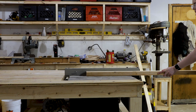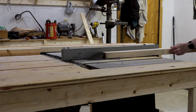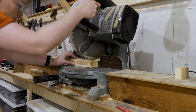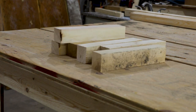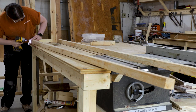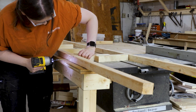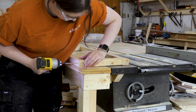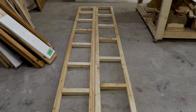Next, it was time to get some more functional storage shelves back onto these walls. I really like the other shelves my uncle and I built last year, so I decided to do the exact same style on this wall too. The bulk of the shelf is made out of 2x2s, so I got to work ripping some down from 2x4s I already had on hand. I'm building an 8-foot long shelf — all it took were three 2x4x8s and a handful of scrap 2x4 chunks. The shelves are made from two basic frames, each with two 2x2x8s and seven 2x2s at 9 inches, attached at 16 inches on center. I messed up the measurements for one of my frames and needed to add an extra joist, but it just makes it a little bit stronger.